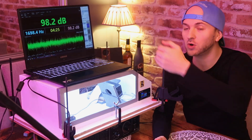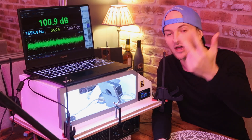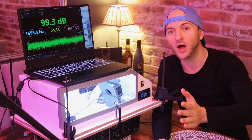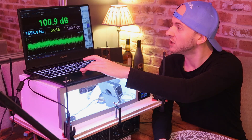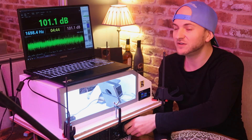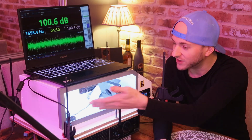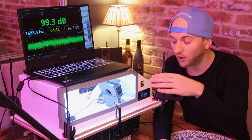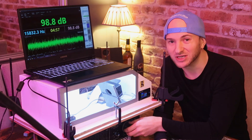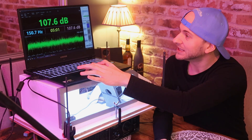As always, we're doing door open first for this range of tests. We're testing 25, 33, 45, and 60 scaled hertz - in real life they're 150, 198, 270, and 360. Let's start off with the lowest frequency at 150 hertz, which is 25 scaled hertz. We're going to increase the level until we either reach mechanical excursion limit or 15 watts on the wattmeter, and we're definitely not going to reach mechanical excursion limit with a pretty small box. Let's see what it's doing at 25.